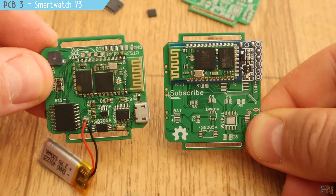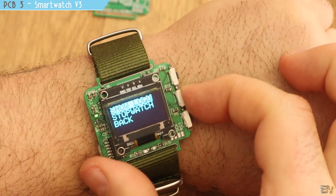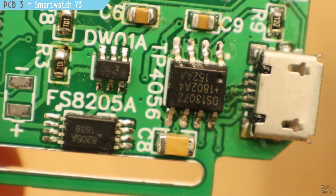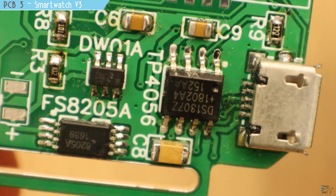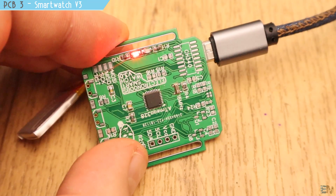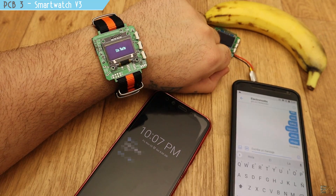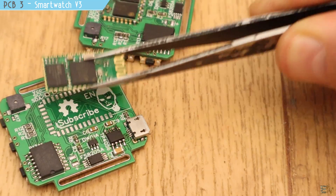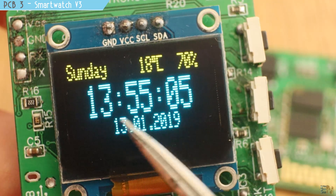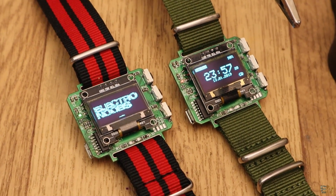Version 2 is a lot smaller and has spaces for a watch belt. It works with a small LiPo battery — the PCB includes a charging circuit and battery protection, so charging via USB is very easy. This smartwatch receives Bluetooth notifications from Twitter, YouTube, Instagram, and phone calls. It can display the date and time, set alarms, and display logos. I'm quite happy with the results.